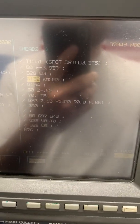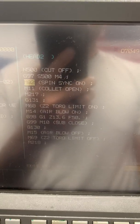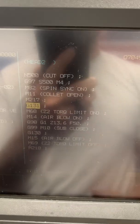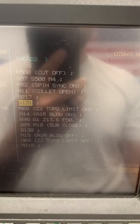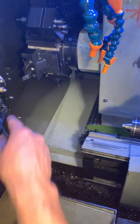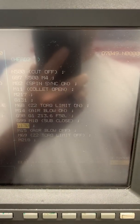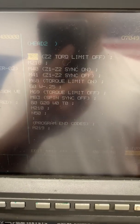Start at the cutoff because that's where everything is kind of established. We're going to N500 — this is our cutoff. Now, we're going to position the sub during this cutoff, so what I'll use is a G131. G131 just tells the machine to ignore its absolute position and only go to a position that's called out onto the part. So we're going to go to 13.6 inches onto this part — it's a 14-inch long part. My machine does not have 13 inches of stroke, so if I were to try to do that it would crash. But the machine now knows because of G131 that this is the location onto the part. So we move into location, we clamp, we cancel the G131 with the G130. You always want to cancel it after you position the sub, and then we continue with the cutoff.